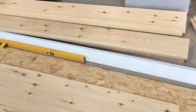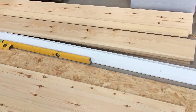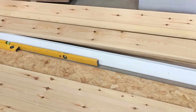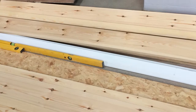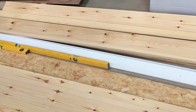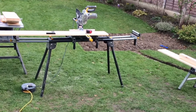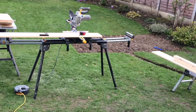Once you've got the top rail up, you can do a dummy trial with one of the gliding rails — that gives you a height to measure from down to the ground, so you know the total length of timbers required. The timber I used was 8 inches wide by three-quarters of an inch thick for my centre planks, and then two sections for the outer parts of the door which were two and three-quarter inches wide, again by three-quarters of an inch thickness. I'll explain the reason for the two different sizes a bit later. Next stage: set up the chop saw or table saw, get an extra pair of hands for the long lengths of timber, and cut your sections down to the sizes you need.